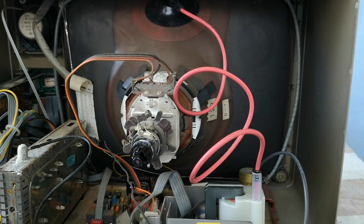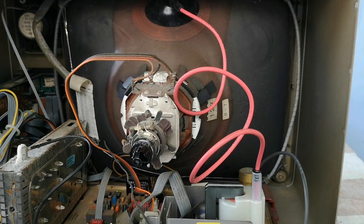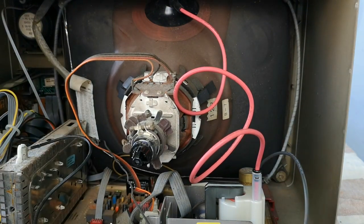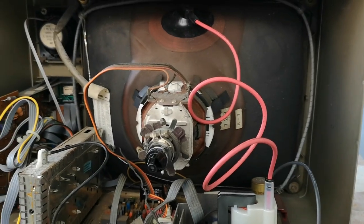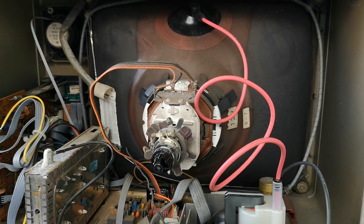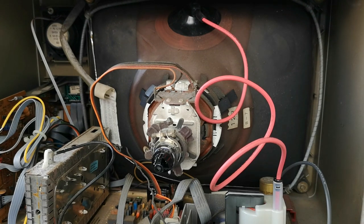I have bought a universal adapter for my BK tester, so hopefully if I can get the pin-outs for these - which I should be able to find online - I should be able to check the condition of the tube. Further signs that it's made in Japan: there's a big '84 mark on this which suggests the set was probably built around 1984. The 'Made in Japan' is probably because it's a Toshiba tube. On the speaker we have 08/14/85, which is an ITT sticker - so that is August 14th, 1985. So we have an approximate build date of around 1984-85. The owner advised it was bought in 1987, possibly judging by a Comet catalogue he managed to find, which would make sense if it had been hanging around as one of their bargain basement lines.